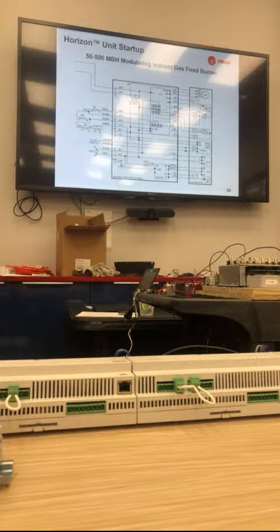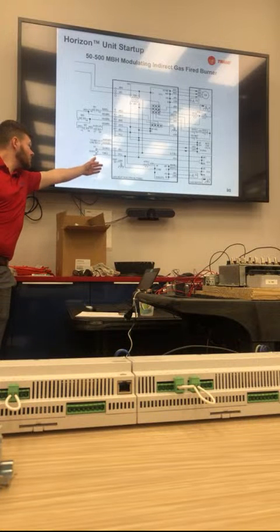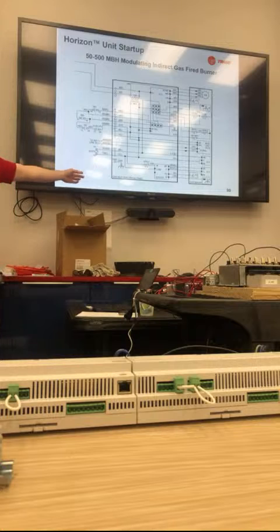We monitor to make sure it comes on. If the gas valve on the modulating side does not make, you will not get a call for heat 2 or heat 3. So it's a safety. If heat 1 goes down, we kill all heat in general, just because we don't know what's going on. It's just to protect the unit. And that's also what we get back as a feedback status as to whether the gas heat is running or not. It's about wiring through that relay.